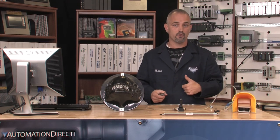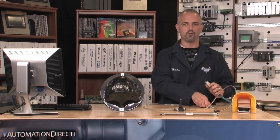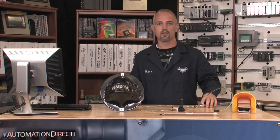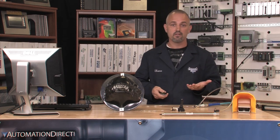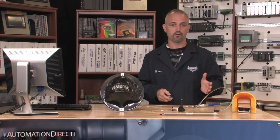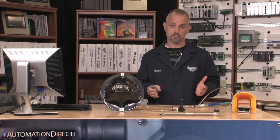I just need to plumb my air supply, and here we are using a small compressor that I purchased at a home supply store. These can be found for as little as $50 if you shop around. I only want to use enough air pressure to move the cylinder out in a rapid but not too fast motion. If you use too much air pressure, you will prematurely wear out your parts.